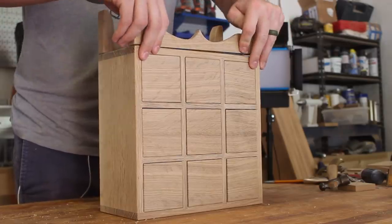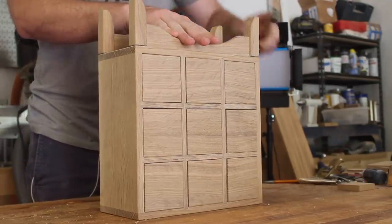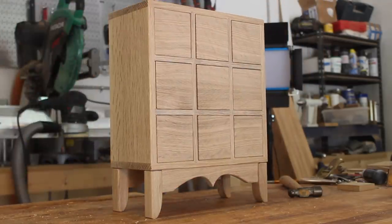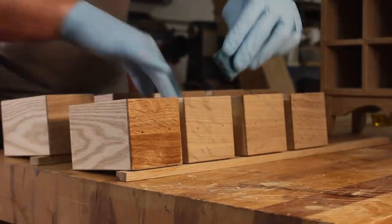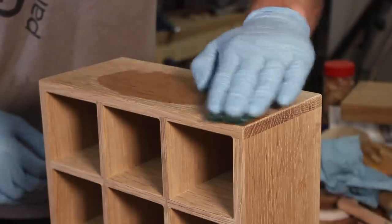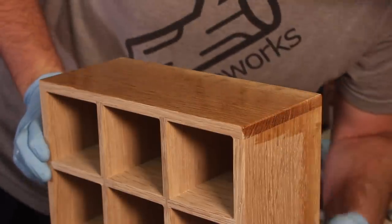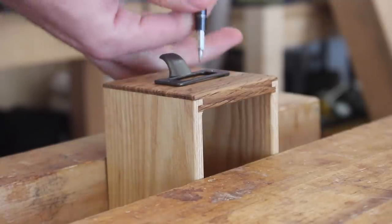The two base assemblies are attached with a pair of dowels and glue — this should be plenty strong, especially on a chest this small. I've grown to really love the walnut oil finish I've been using lately. It's easy to apply and also easy to supplement down the road. Finishing the inside of the cubbies is a little cumbersome, so I might consider pre-finishing before the glue-up. After 2 coats of oil, the chest will get a wax and oil mixture on top. Once I add the 9 drawer pulls, this little guy is done.